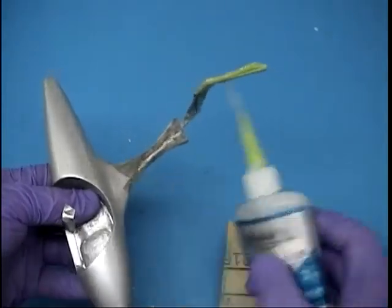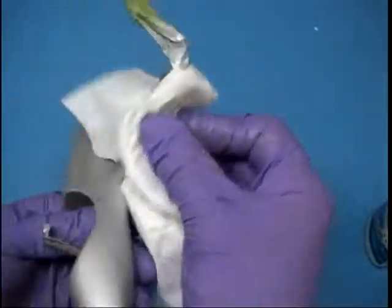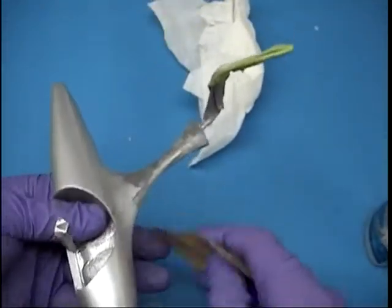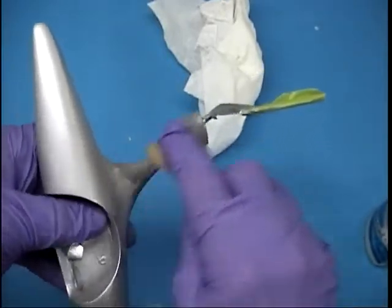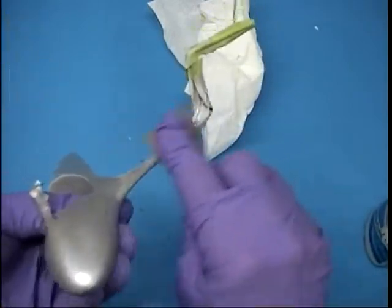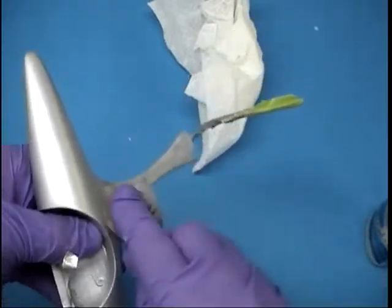And a lot of times if it's really bad, I mean, if you're down into absolute raw wood and it's raw wood sticking up, you can always put some thick CA on there too. But each coat, you shouldn't just put coat after coat. Each coat should get a tooth. Anyway, those are some of the tips that I'm using in the process of sanding the silver out.